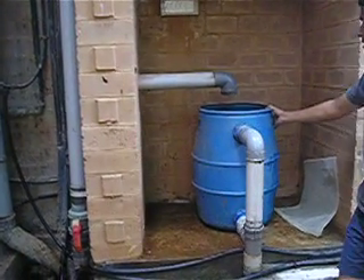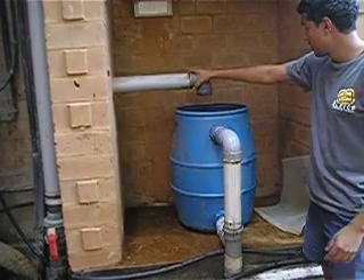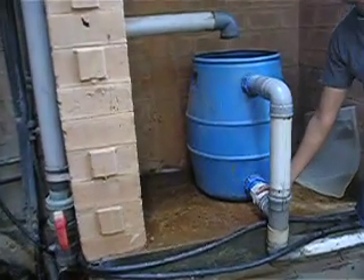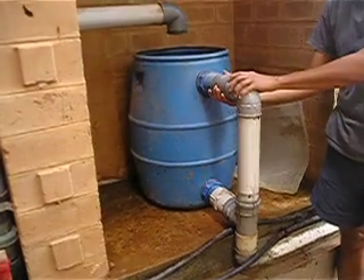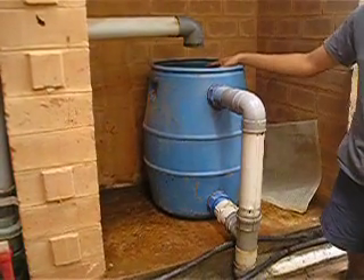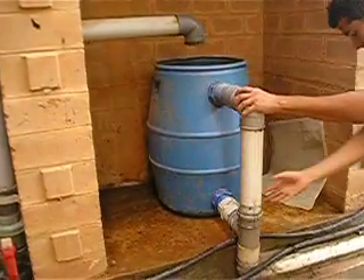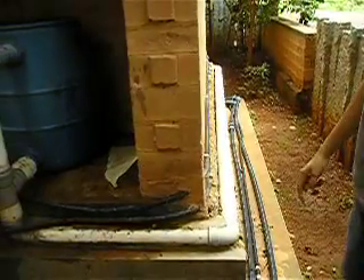This is the actual filter itself. This pipe is the inlet for all the roof catchments — the water comes in here. This is the filtered water that comes out of the filter. This is the bypass of the filter itself, and it's there when the rain is very heavy. If the flow rate is very high, the water is quite clean anyway, and it just gets bypassed and comes out here. Both of these lead to the sump that we saw in the first video, and into the area where we use the water for any household needs.